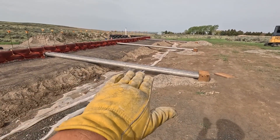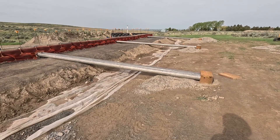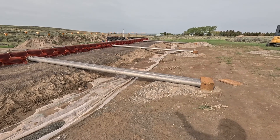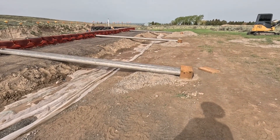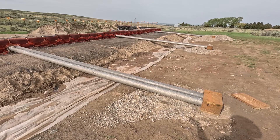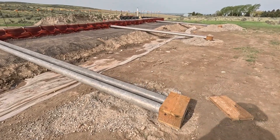Being a smaller volume of air inside would actually help cool things down just as well, or maybe even a little bit easier, while the amount of metal touching and getting cooled by the earth is basically the same by doubling up the two six-inch pipes. There's a little bit of a slope to them - basically quarter-inch per foot, standard plumbing slope - so any moisture or condensation that collects will just run right out. And because it's not corrugated culvert pipe, water shouldn't get stuck in those little pockets.